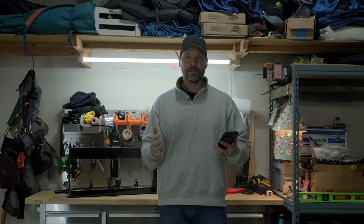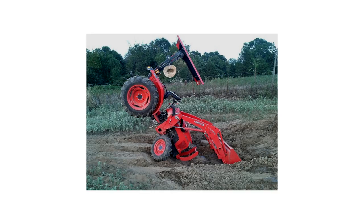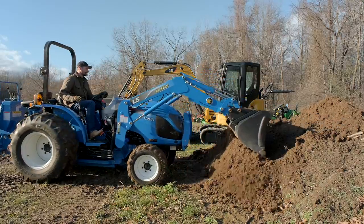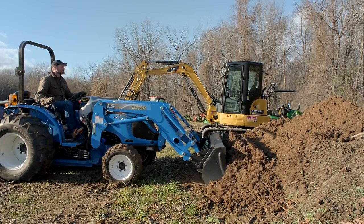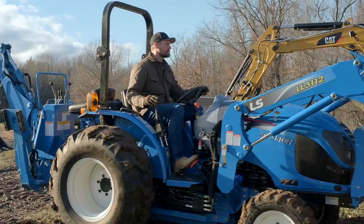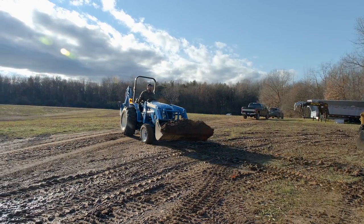Now let's go through a whole slew of other ballast weight options and talk about just how important ballast weight is. I have fortunately never had a complete disaster, but I've had my fair share of close calls — normally because I don't have enough ballast weight on the backside. Even recently, we were testing out an LS tractor, a 40-horsepower tractor, lifting up some buckets of dirt with a front end loader. It had a backhoe on the back but no loaded tires and no wheel weights. When the bucket was full of dirt, the back end was starting to lose traction with the ground — it was getting light, and I could feel a little bounce, which means you're on the verge of being unstable.